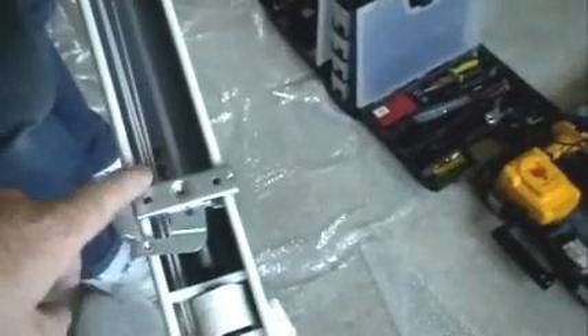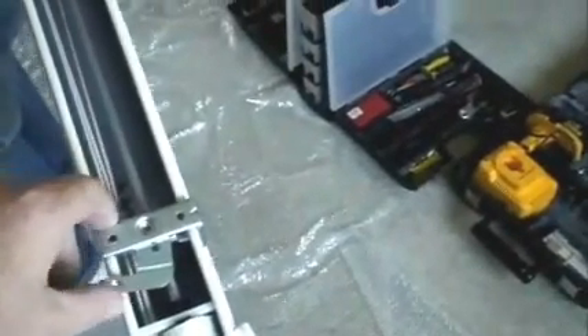We're fitting a wood venetian blind. I'm showing you that the brackets we're fitting have been located into the head rail so that we know where to mark them up on the window. There are three brackets on this one, which we're going to top fix. We're now going to offer it up into the window so that we know where the bracket positions are.